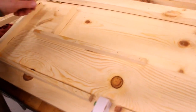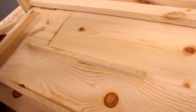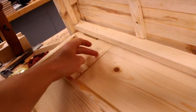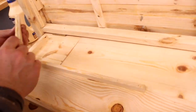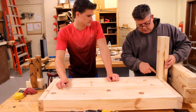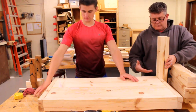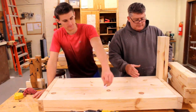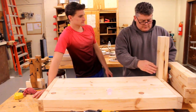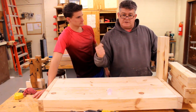If some of you are wondering about this weird ledge right here, we're just putting it there in case we want to separate things on our little shelf, and also it helps cover up some of these seams which are kind of ugly. When we attach these legs, we're going to come from an angle and drill down here, then put two screws on the side — four screws per leg. The way we made the leg, all the weight of the bench is going to be on this, and then we're going to put some runners in here to connect the legs together to stiffen it up.